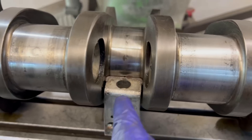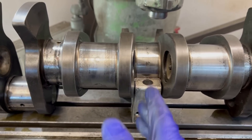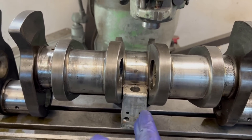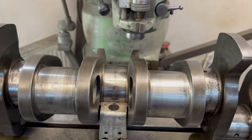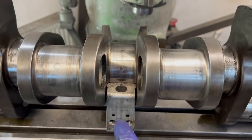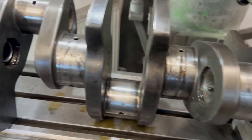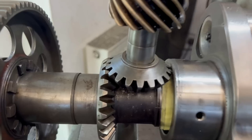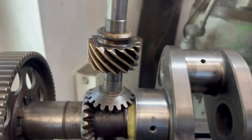Going back to the center main bearing — the panel of the crankcase which this is fitted to was able to deflect under the force of the coupling shaft. We're only talking about very small amounts: twelve thousandths of an inch, or about 0.3 millimeters. But an additional 0.3 millimeters of clearance in these gear teeth was enough to cause the damage to the skew gear.